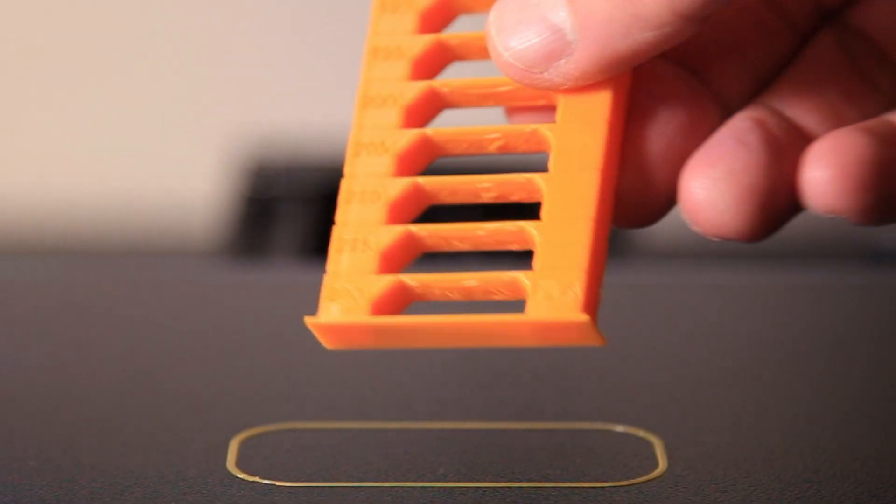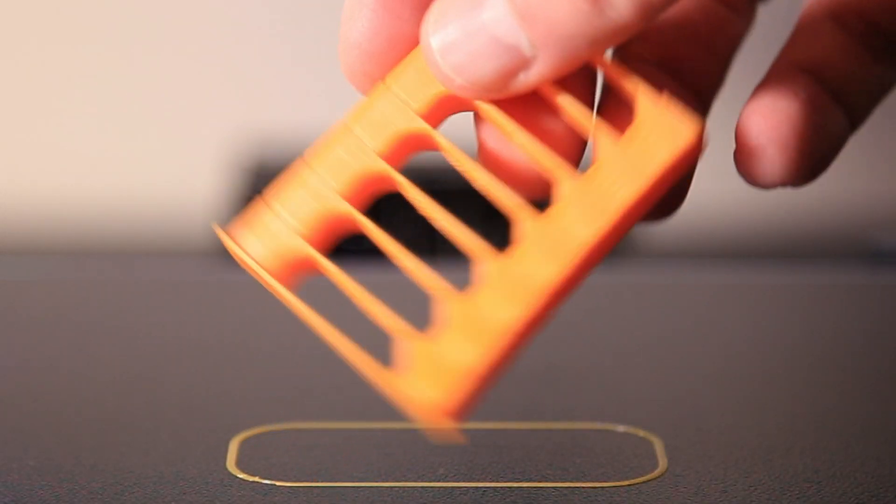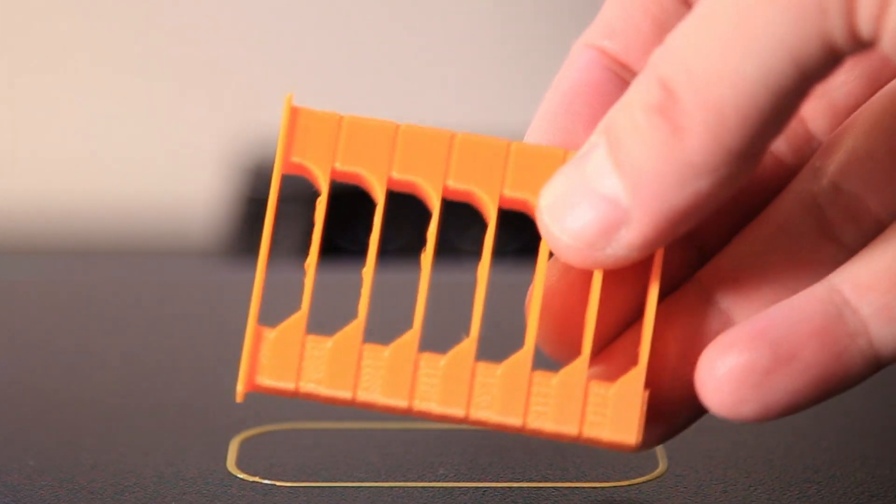So what do you need to look for? Well, first of all, you need to visually inspect the temperature tower. If the purpose of the print is not functional and the only thing you're concerned with is the cosmetic look, then a visual inspection is enough — look for the zone that looks best and print at that temperature. My recommendation is that if two zones look equally good, print using the zone that is at the higher temperature. All else being equal, the zone with the higher temperature will probably yield better layer adhesion and therefore be a stronger print.